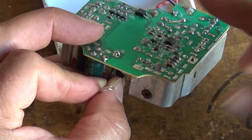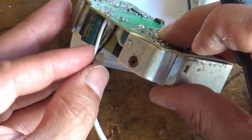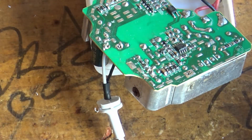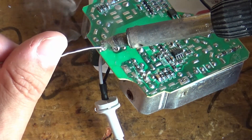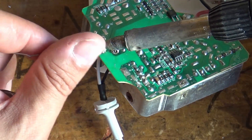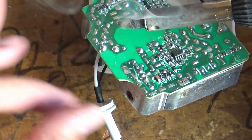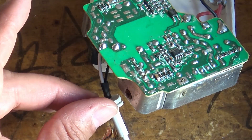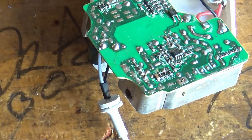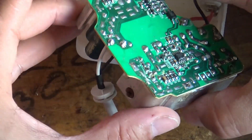We'll pop a little bit of fresh solder on that. Then the white goes towards the outside of the PCB — we'll put some real leaded solder on that. There we go, and you get a little refill as well. Smashing. Nice shiny joints there, all looking quite magnificent.